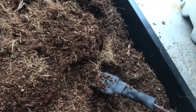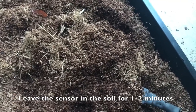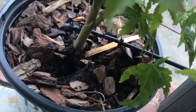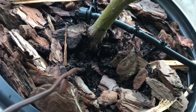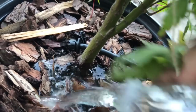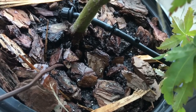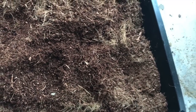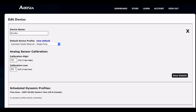To calibrate the sensor, instead of using dry air I've got the soil sensor in actually dry soil, which is a better representation of the lower limit. Then we're going to insert it back into the plant and pour water on it to drench it, to get a good saturated soil reading for the upper limit — rather than submerging the sensor in full water. We've got our moisture sensor down in there with the drip line and we're pouring water all over the sensor to make sure it gets well saturated. We'll use that as our high moisture reading, which is the low analog value.